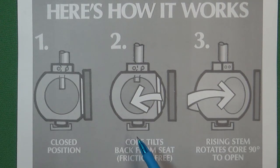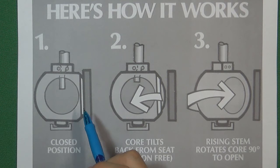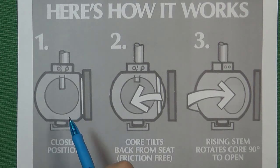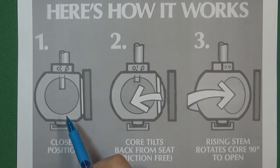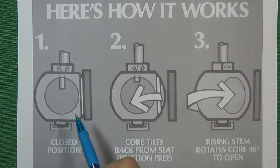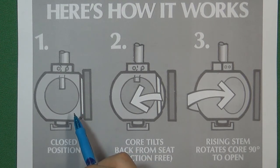To design a valve which can open and close very quickly and also work in that kind of critical temperature environment, a ball valve is a very good choice. But we need to improve the ball valve's function, because in the original ball valve the ball always touches the valve seat. If this ball valve works in that critical temperature environment, the temperature difference will deform the ball and the valve seat. So when we go to close or open the ball valve, the ball will scratch the valve seat, which can damage the valve seat and the ball, and the valve will leak.